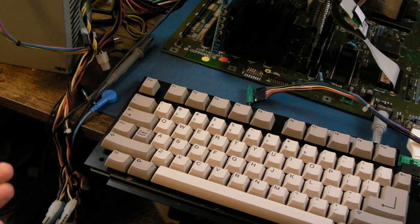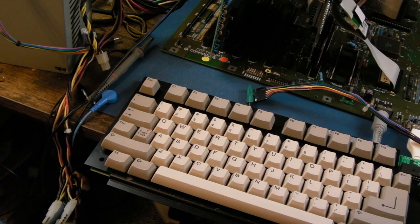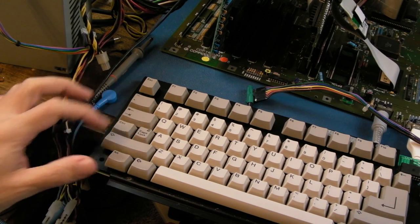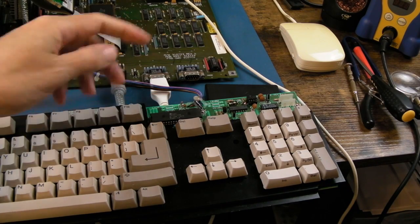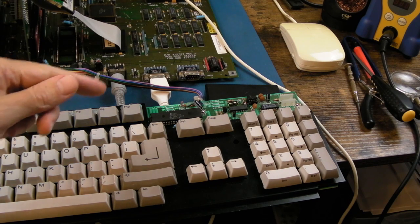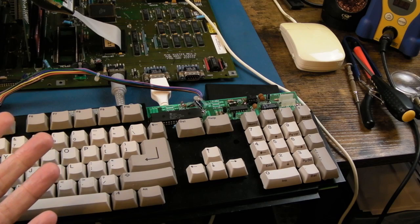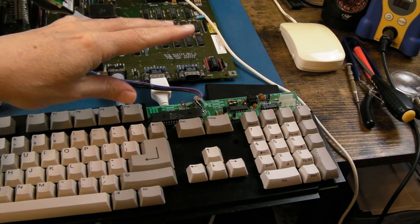And I'm like, hang on a minute, how did we get to this point? I fixed some traces, we changed the 555 round the right way, it was all good and working, and then why did it just suddenly stop working? So yeah, it was haunted at that point. It was just not oscillating properly. And you can wonder why. Why would it oscillate for a period of time? And then Anthony was pointing out you could switch it off, leave it overnight, come back the following day, and it would work again, maybe for 10 minutes or so, and then stop working and not work again until the following day. So yeah, it's all about impedance and temperature.